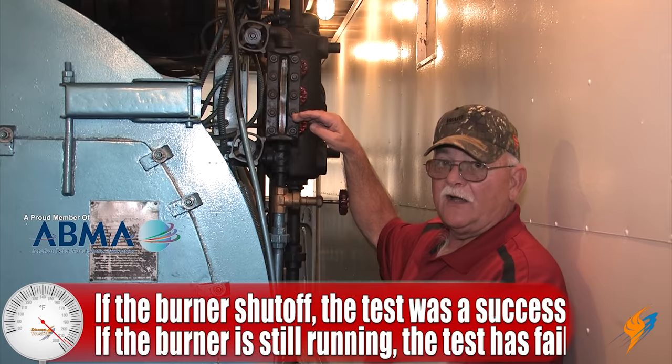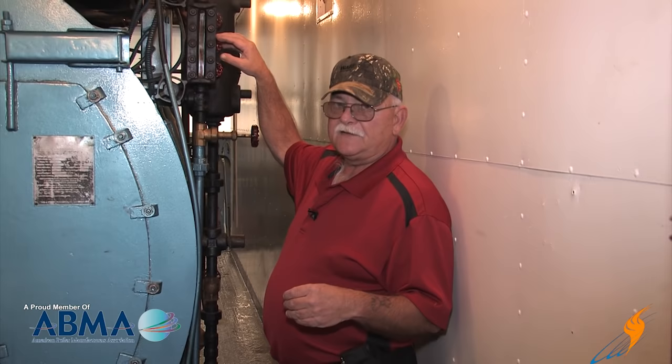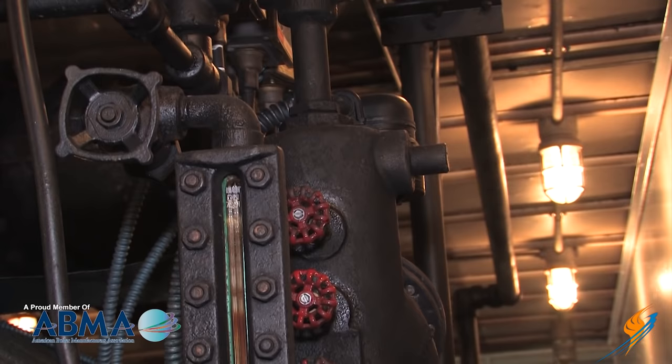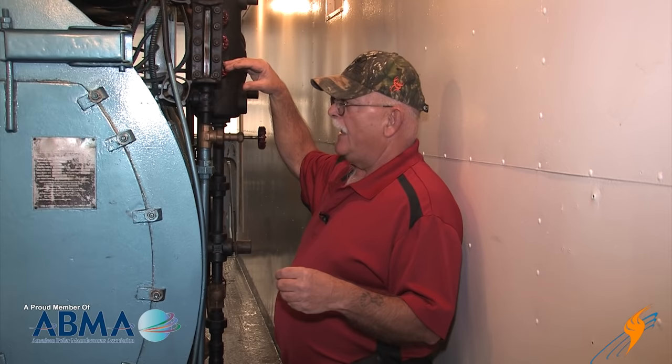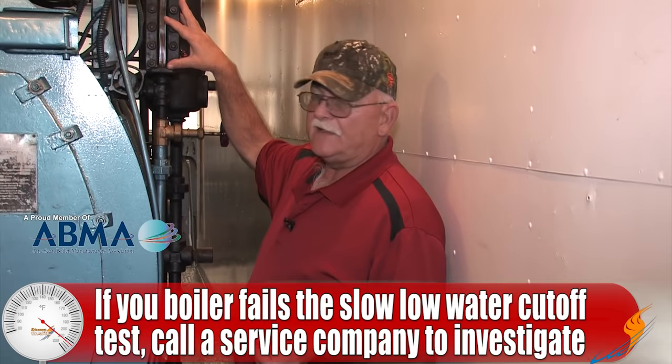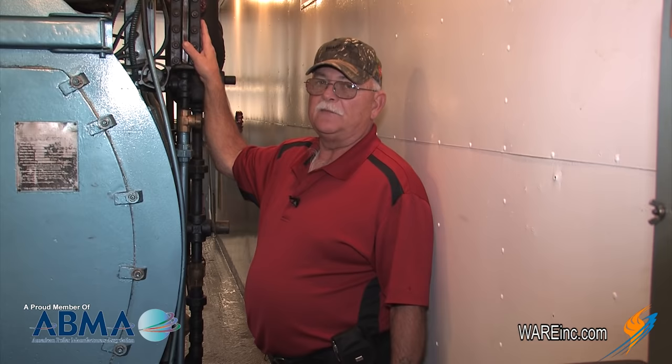Once you get the burner shut off, or if the water level gets to the bottom of the sight glass, at that point you would turn your pump back on, get the water going back to the boiler, and then you have the question of where was it going to shut off. Most of the time your manufacturers will have the sight glass positioned where you can see that your low water cutoff is working. Sometimes that's not the case — at that point you need to investigate why. Is the sight glass at the wrong position? It can be changed if need be. Or are you truly having a problem? At that point it would be time to call somebody in and check — the slow low water cutoff test failed, at least until we have an answer.